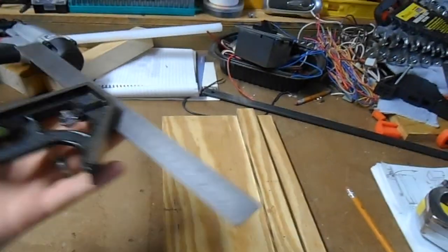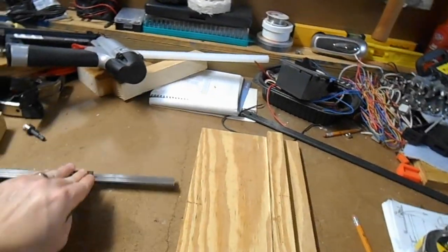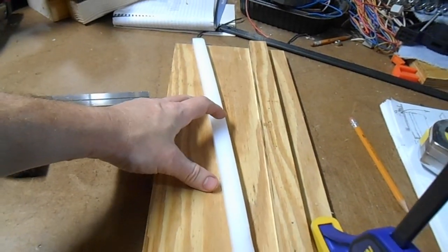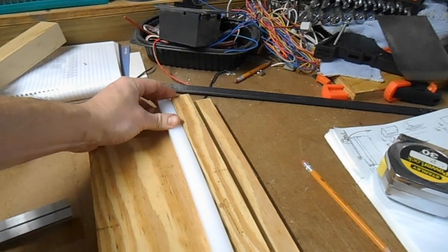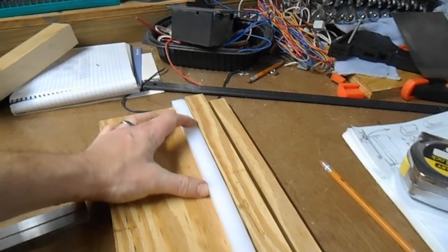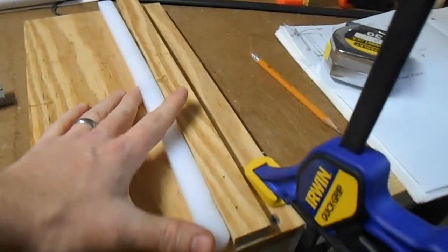I have sunk my screws with countersinking and cleaned up the glue. The important part is the glue on the underside, because that edge is what rides along any lumber the jig will be aligning your saw for. I've found an alternate use for my bucket of crap — it held the piece while it was clamped. With this in place I can begin to focus on setting up the fence. I've tacked down the first main guide rail with 1-inch brad nails, offsetting it precisely along its length using a combination square. I set it at 4 and 5/8 inches — not that it matters because your saw will be different. Now I'll pre-drill the polyethylene, countersink it, and anchor it tightly against the wooden fence as I go.